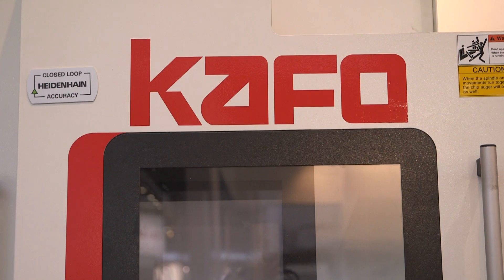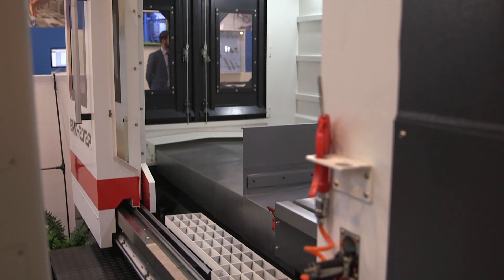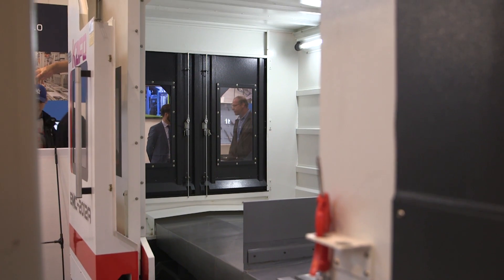Yeah, on this particular machine we can do a 90 degree head or universal head, which is a manual change. The K range of this machine is a fully automatic head change. You've already mentioned this is the smallest machine in the range, so how big is the range? With this type of machine we go up to 10 meters in the X-axis, and with the KRV range we've also got our moving column, with a maximum Z-axis of about 2.6 meters. All of these double column machines have coolant through the ball screws, so we don't have any thermal expansion in the machine in general.